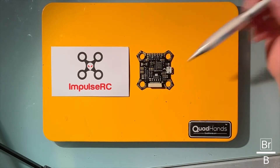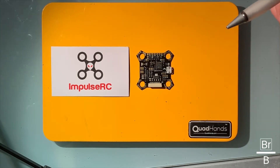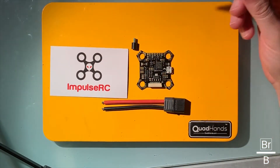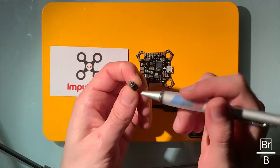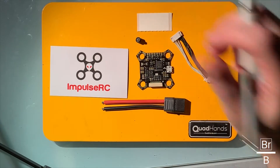Similar layout — you've got a wiring harness in the back. This will connect to KISS version 1 flight controller, version 2 flight controller. I've been told the FetTech flight controller also works — I'll leave a card up here for that. USB port, your LiPo leads. It does come with a LiPo lead and four of these little isolation screws or mounting posts. There's a female thread on the underside and an aluminum or steel post with rubber isolation to help keep vibrations out of your flight controller.